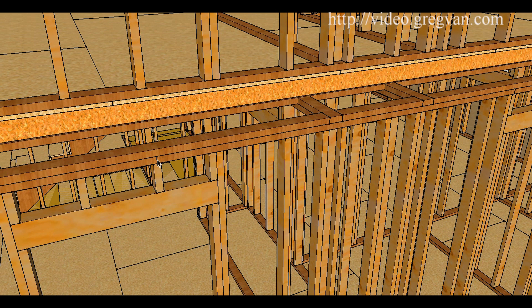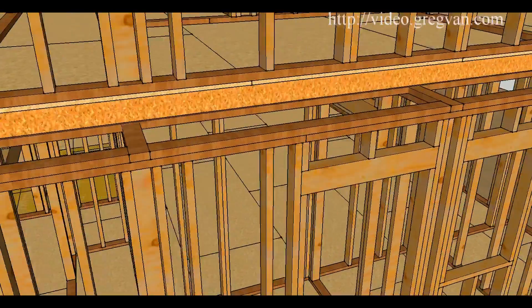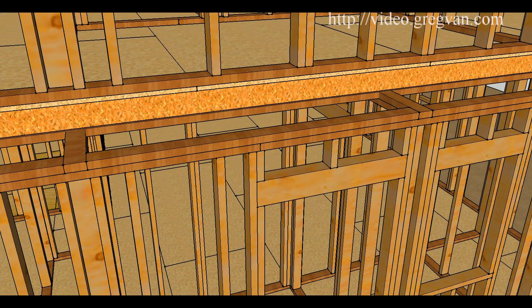The next break is over here. These breaks aren't going to make a difference because the bottom plate basically carries the load. The next tie is going to be over this plate here. If there was a break here this would be a totally different scenario — it would require a strap. I'm going to provide you with a few examples so you can understand what's going on.